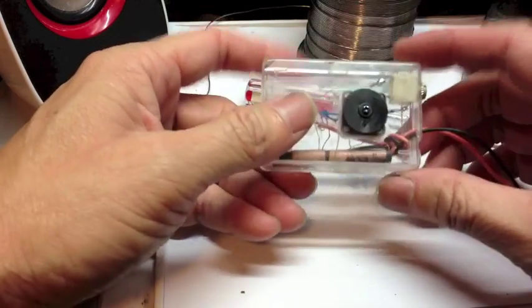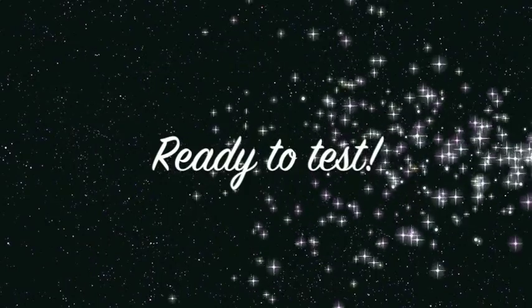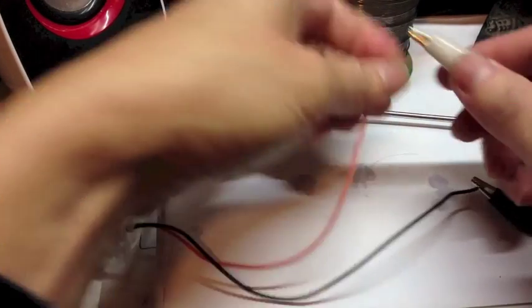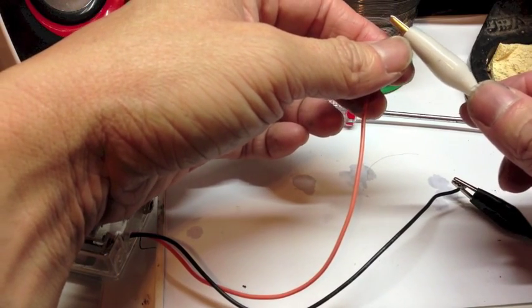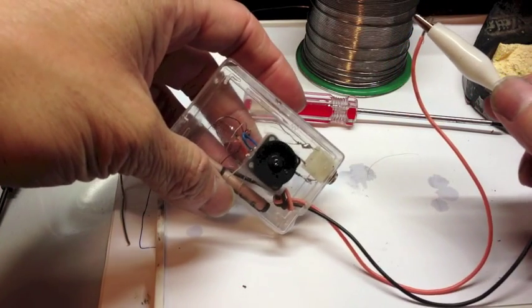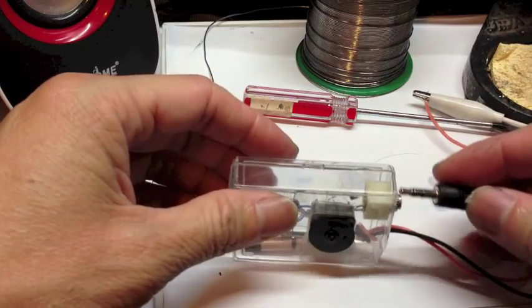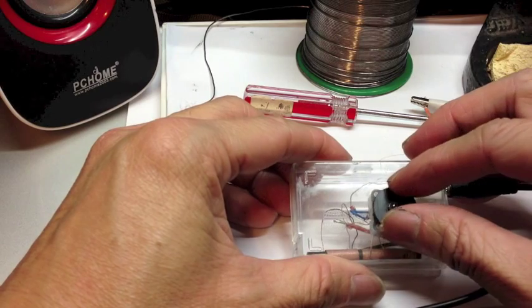And there you go — you have your first transistor radio. Let's test it. First, let's connect the grounding wire. Then connect the antenna wire. The antenna wire needs to be high, aiming from your window — at least 20 meters of wire. Make sure you have protection from thunderstorm; don't try it out when there is a thunderstorm. Lastly, let's connect to the PC speaker amplifier to see if there is any music coming.